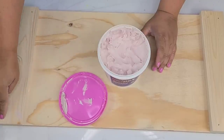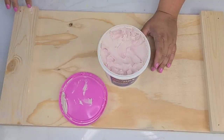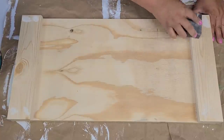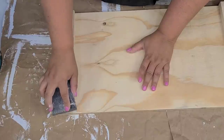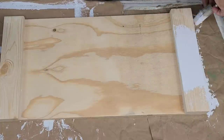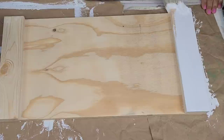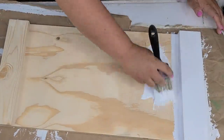I'm going to fill in the nail holes using wood filler — you don't need much, just a little bit. It dries pretty quickly, and once dry I sanded it down with my block sander to smooth everything out. Then I painted everything using regular household latex white paint, because we're not going to distress it with a sanding block — we're going to distress it using dry brush techniques. I gave it two coats.